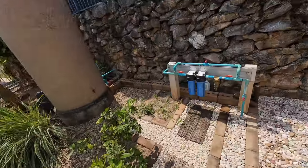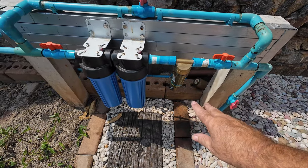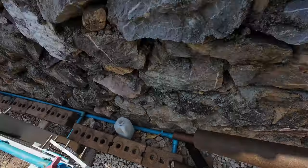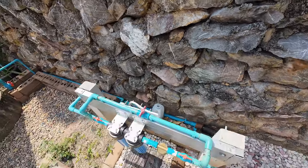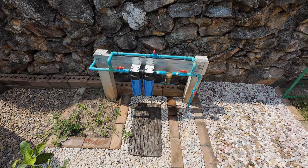In reality, I live close to the main water source from the lakes, so I think we're among the first half dozen houses that get this water, which means there's a lot of dirtiness in it. Basically, this spin filter needs cleaning out every two or three days. The other two filters are a five micron filter and a carbon filter — these clog up within a couple of weeks, but it's not too expensive to change them.